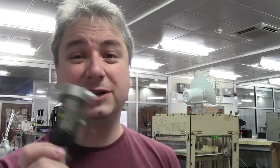That one will do it. There we go. Right then. So got something to measure my reel with. So my reel width, we switch this on, make sure that you're working in millimeters. When you get one of these, make sure position is at least up to 0.01 or something like that. You don't want to go any lower. So nice and zero. Then we start to measure this. So peel off your plastic leader tape.